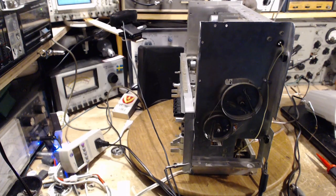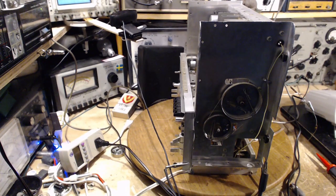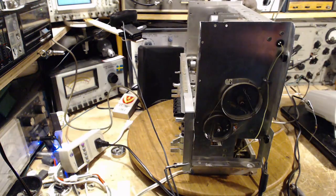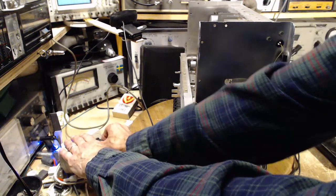75 microamps. That's 75 millionths of an amp. That sounds like you couldn't even feel it if you wanted to. Let's take a look at the voltage here on this unit. This is more typically what I do. Check voltages between things I've never connected before, even when I'm pretty sure there shouldn't be any voltage there.